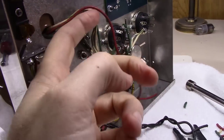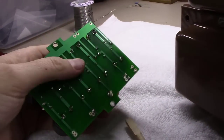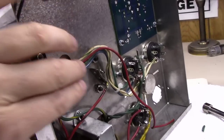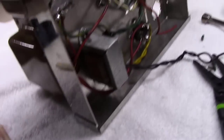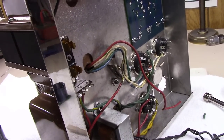It'll give me good clearance over these wires so you're not squishing them with the sharp little pointy solder tips here on the back side of this board. So I can actually put a piece of cardboard or something over these to protect them a little bit. But 3/4 is what I need, and I'll need 2 per amplifier, so I'll need 4 total. Let's jump over here and see what we can find.